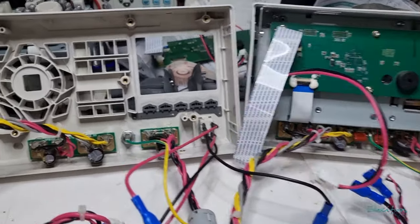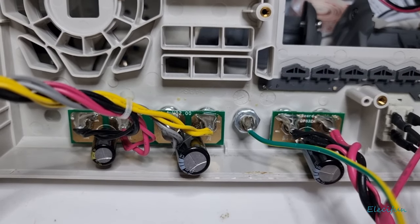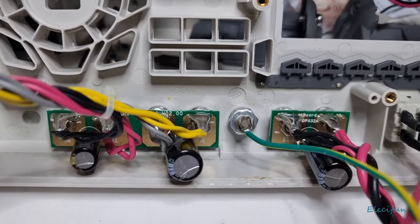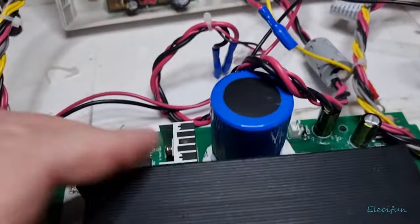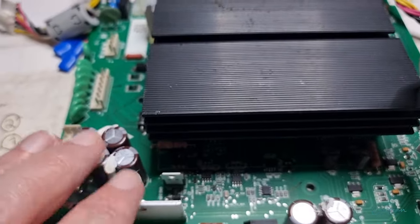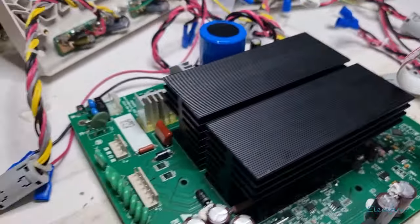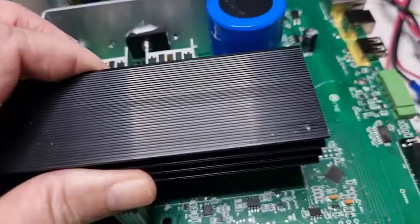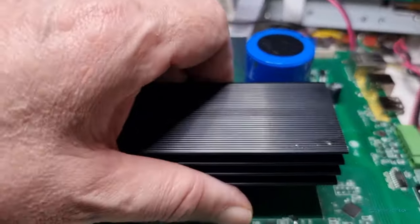So this is the offending power supply. I've put in the capacitors — not properly soldered yet because I need to get through the solder — and I did a test: no difference. I also stuck a nice big V-shape filter cap on the main cap. I've swapped these caps out, and those I've swapped out too. I put them in and did the check, and it's still the same — it's still got noise on the output.